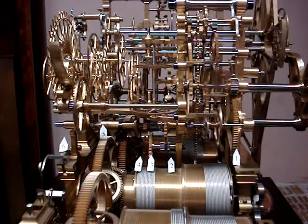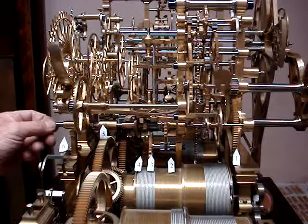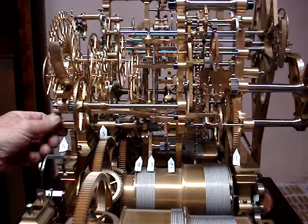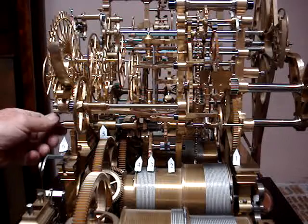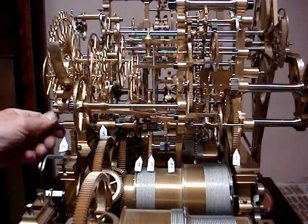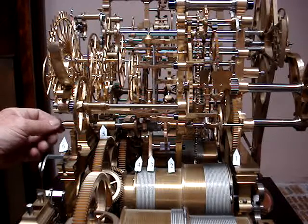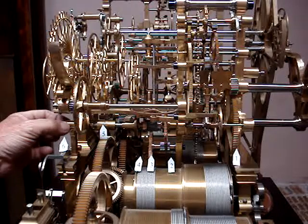If we move the selector out one stage to that point, I can then drive all the complications — you will see we have now disengaged clutch 1. Pinion at position 3 is driving up to the orrery, as well as the position 6 clutch being engaged,